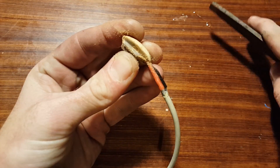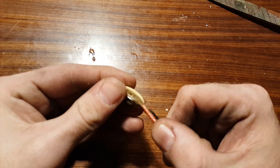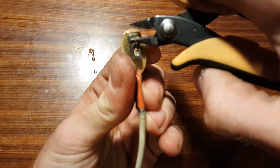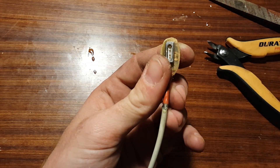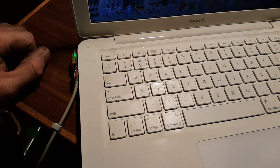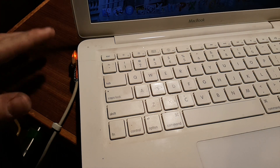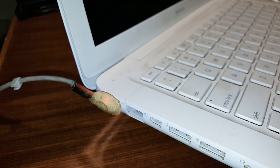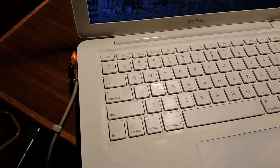We've left things overnight to dry because I accidentally bought 24-hour epoxy instead of the five-minute stuff, but it's looking pretty good. We got a little air bubble here — we'll just clean things up with a file. Remember it's key that you didn't get any epoxy on the pins themselves, because they're little spring devices and if you got epoxy on those you're pretty much screwed. That's looking pretty okay now. And it appears to work! Not only does this protect the butchered MagSafe connector from damage, it also looks like there's a glowing pistachio sitting in your charge jack — and you just can't buy that kind of creativity. Good night hacking, and till next time, TK out.